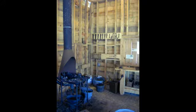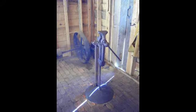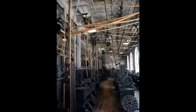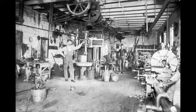In addition to being able to do woodworking and blacksmithing, having a metal lathe would have been a big plus that allowed metal turning and threading. Similar to what is shown here, the shop would have had a line shaft to power the lathe and other machines. A line shaft was a way to transmit power from a central source, such as an early electric motor, to each machine in the shop. This was common up until the mid-1900s when individual motors for each machine became available.